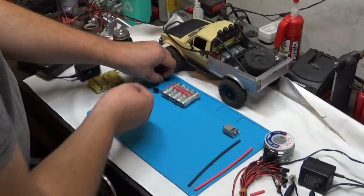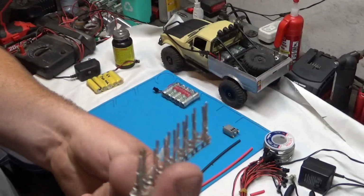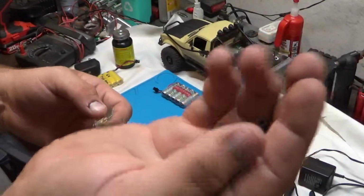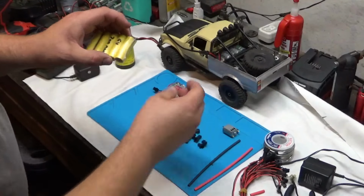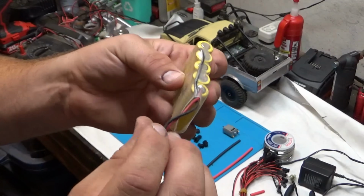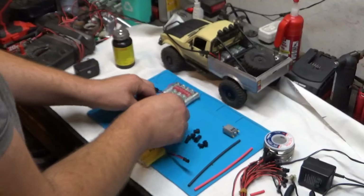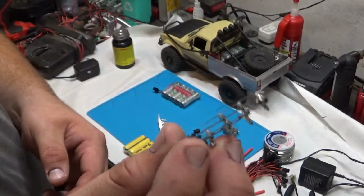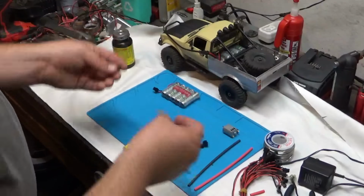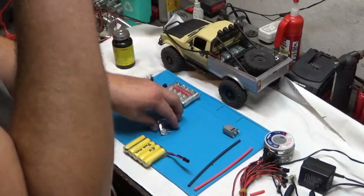And I also ordered the kind of build it yourself type, where you get a whole bunch of little contacts and you can solder whatever wire you want on there. And this is what I use to make my battery side, because I like putting the really thick, like 18 gauge wire on here. So you just pick your two of these guys, solder your wires into them, stick them in the plug. They snap in. I'll try to find a link to that and put it in the description as well.